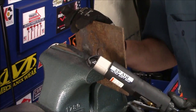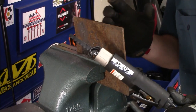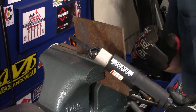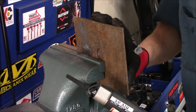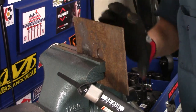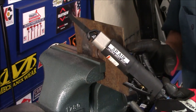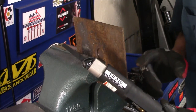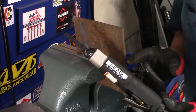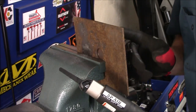One thing that you typically cannot do with any air saw is cut through very thick metal — and when you can, it's not very efficient, and they tend to hang up and stall out. In this case, we have a piece of plate steel clamped down in the vise — it's 3/16ths thick by 6 inches long. The gear-driven saw, which is going to be the SP Air, will be able to cut through this very efficiently. It's not going to slow down and it's not going to stall out, where a cheaper saw with a piston style would hang up and you would not be able to cut through this.